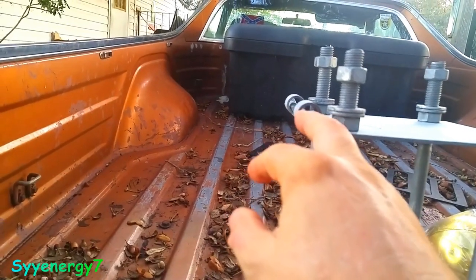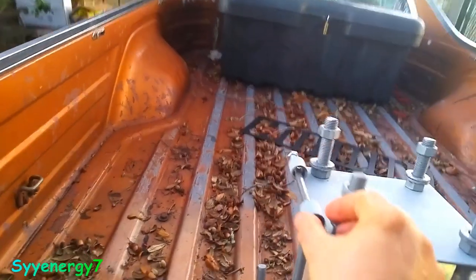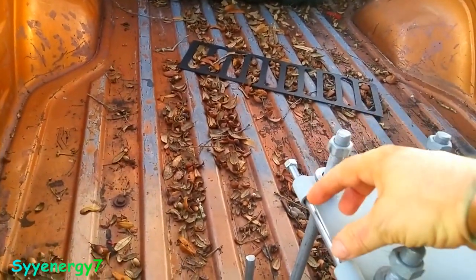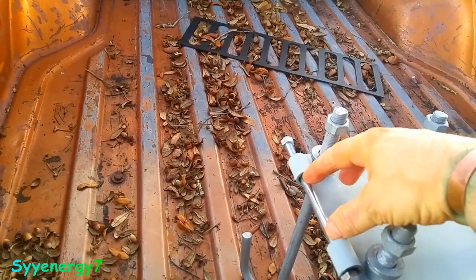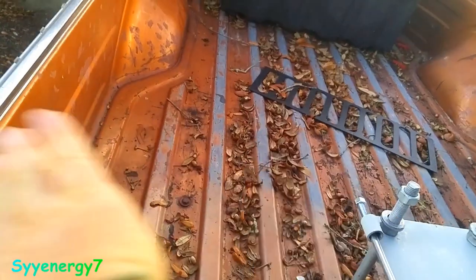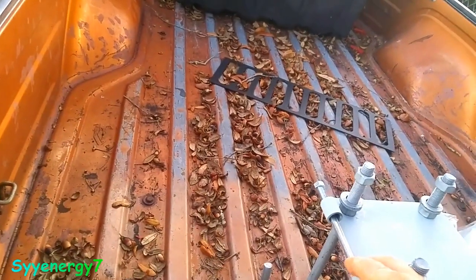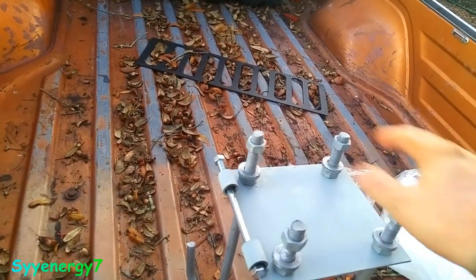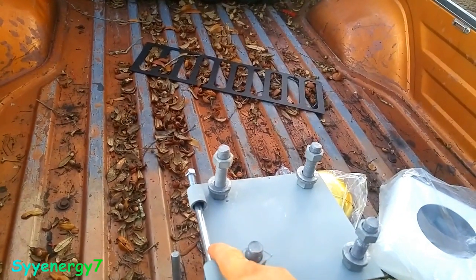What happens is there's a plate on the pole itself, and when you lay the pole down, the hinge is in here. It sits on top — the plate, the other plate for the pole itself, sits this way. The pole is laying down horizontally. Once you line the plate up, you put the pin in there because they'll have a hinge on the other side, and you start raising the pole.